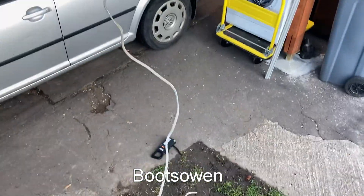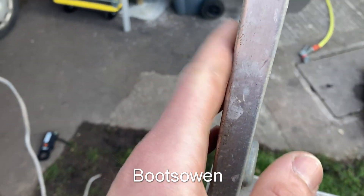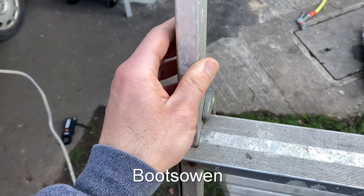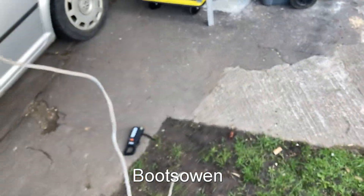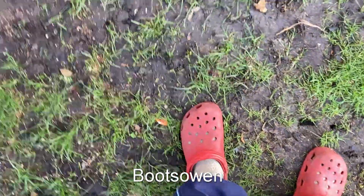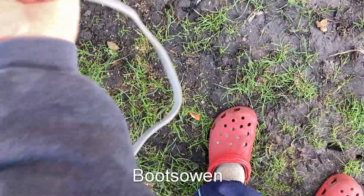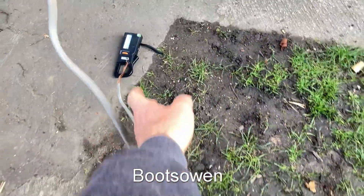So there's my new earth cable dangling, and if I recreate the fault — if I touch this with one hand and touch the roof with my other — before I was getting an electric fence type shock, a very slight tingling in my fingers. Let me try it again, but right now I'm getting nothing. And the test for this is to pull the cable out of the earth — just touch it into space, or yeah, it's resting on the plastic there now.